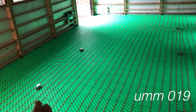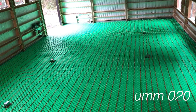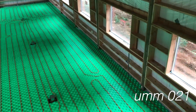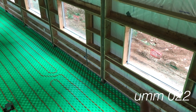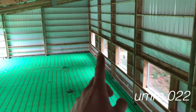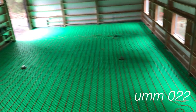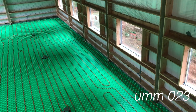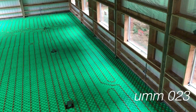In terms of spacing, most of the spacing is one foot on center between each pipe. But around the edges, I've got nine inches instead of 12 inches on those outer lines. There's also nine-inch spacing all the way around the outside. The idea is that heat will be escaping through the insulation on the side, so we want to pump a little bit more heat into those edges.